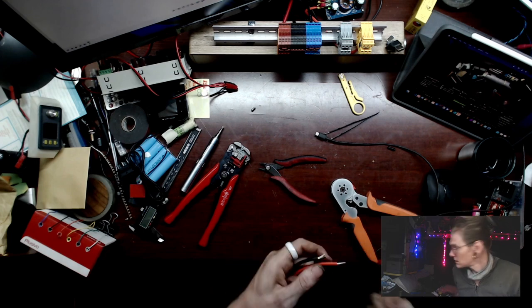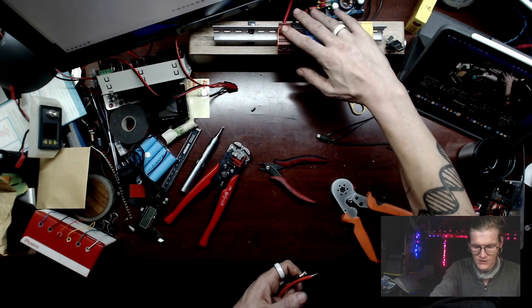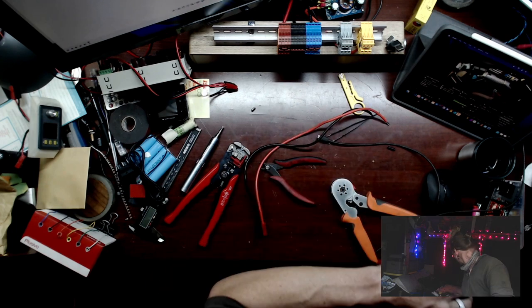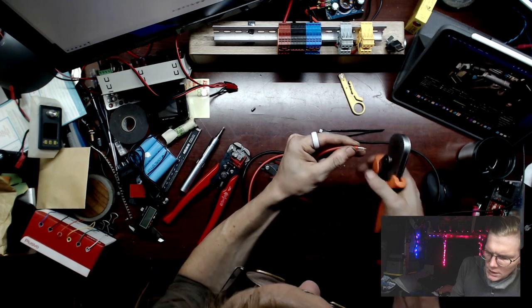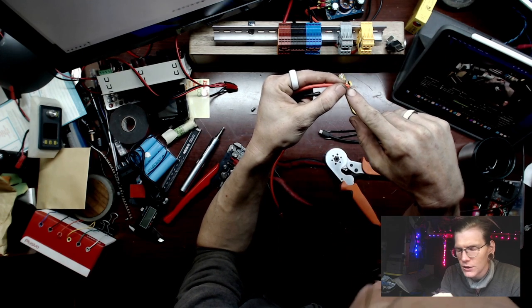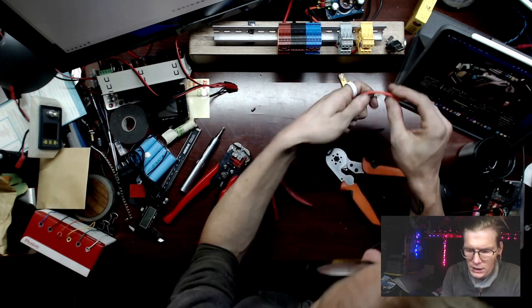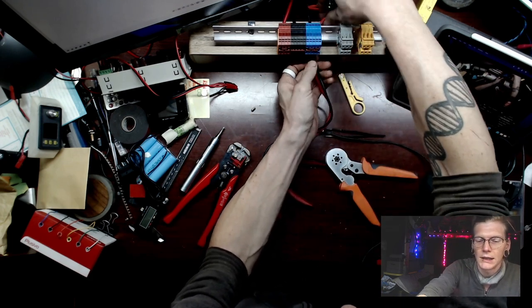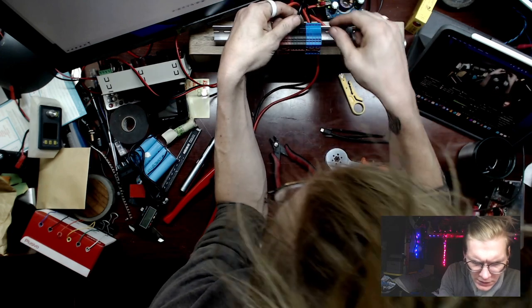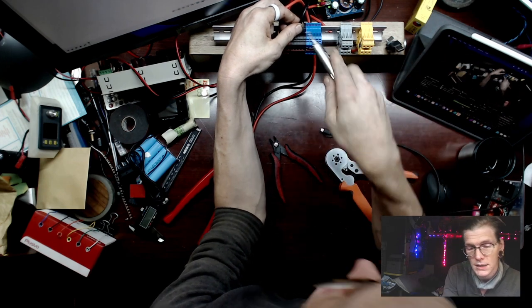It's good that we're doing this because this is kind of like a step I needed to take to start moving the electricals from under the desk onto this, which is then eventually going to go into the redesigned desktop, which is actually going to have storage in there. What I do when I'm crimping these ferrules is I create a pattern, then go halfway in between the pattern — axially or laterally — then move it towards the end and crimp the tip a little smaller so it can fit into these a little easier.